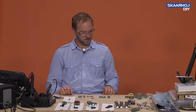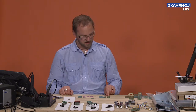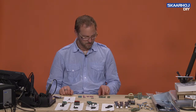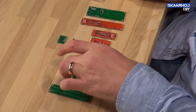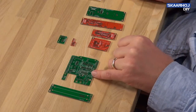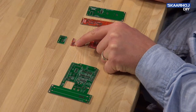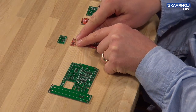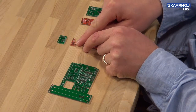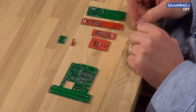So what do I have right here? Just some examples. This is a board for a linear slider and this is our breakout board. The breakout board is supposed to be mounted on top of the Arduino and it has a flat cable connection to the other boards. We have a small breakout board for a display and it just converts a connection to the display to the usual header we are using so that we can have a nice flat cable daisy chain connection.